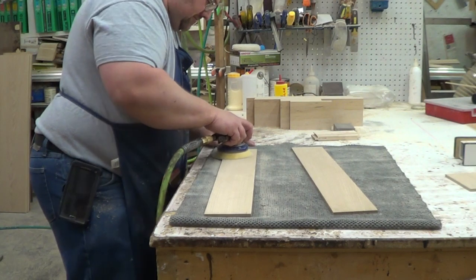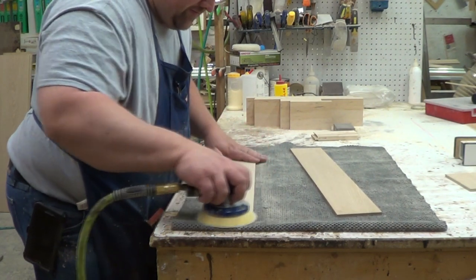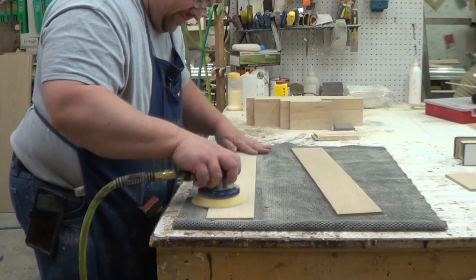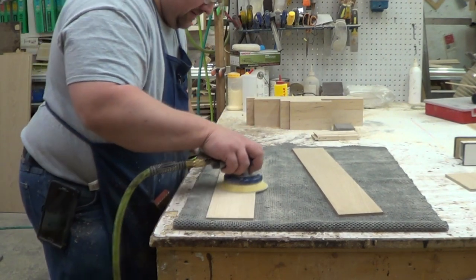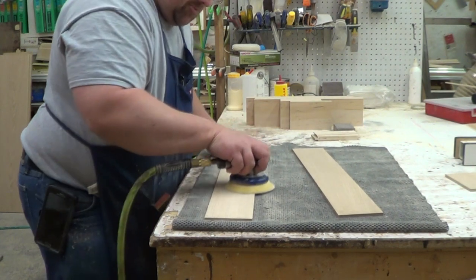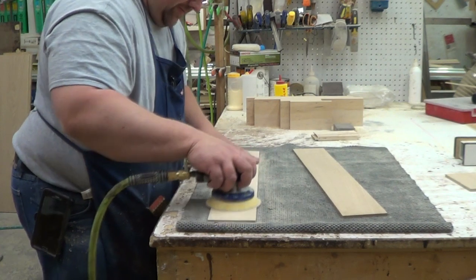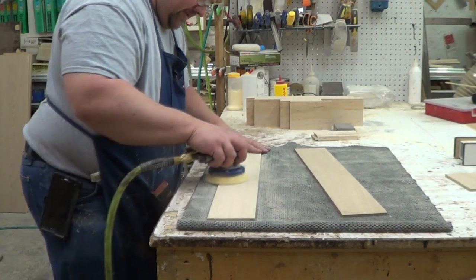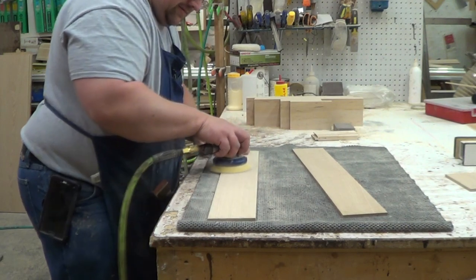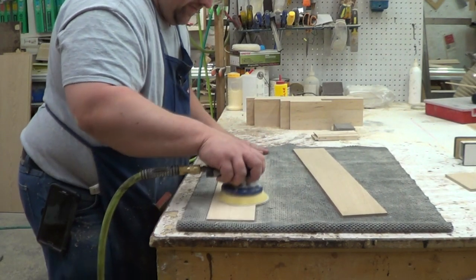basically as a demo unit when I was buying my sandpaper, just to give it a shot. At the time I had a Campbell Hausfeld single stage air compressor, 60 gallon, and it was everything it could do just to keep up with the demand. It got to the point where it just couldn't keep up. If you have one of these air orbital sanders, a 60 gallon single stage won't cut it. It'll work for a while, but it won't maintain what you need.